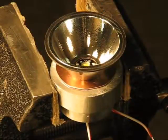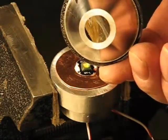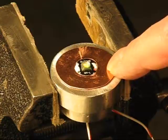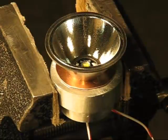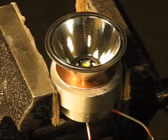What I ended up having to do was enlarge the opening in the reflector so it would fit around the entire star because it needed to go deeper. Once I did that I found the beam was very ringy because the reflector was too low, so I had to make a copper shim to lift the reflector back up to about even with the star. Now I've got a pretty decent beam — not perfect, I could probably shim a couple more thou to get it perfect — but there's no real bad ring, just a little tiny dark spot in the center. It's got a pretty good flood, so I'm going to leave it at that, and the next thing will be doing the circuit board.